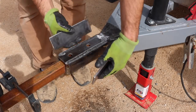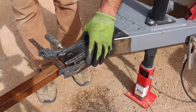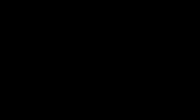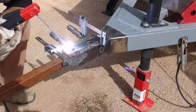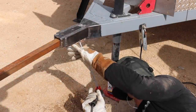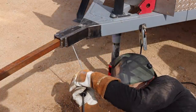With the initial piece added, the tongue has gone from two inches wide to two and a half inches wide. Now I'm going to add two extra pieces of quarter-inch steel on either side to bring the total width to three inches. I'm using the same process - tacking everything into place and then doing each weld, letting them cool for 15 to 25 minutes in between.